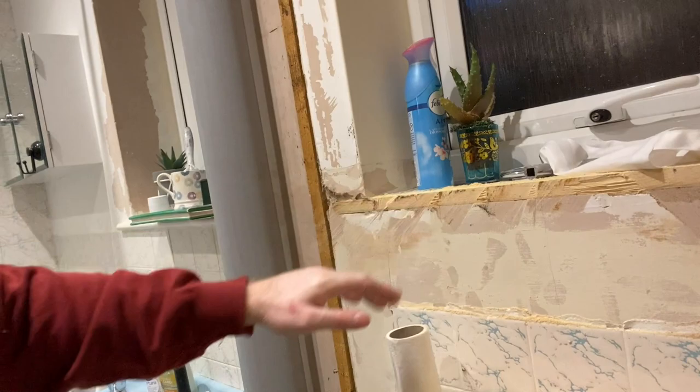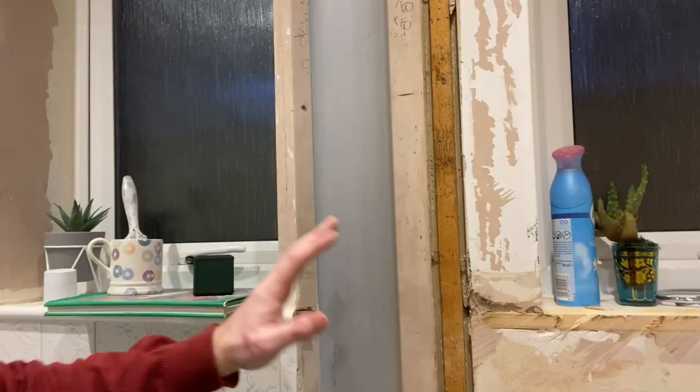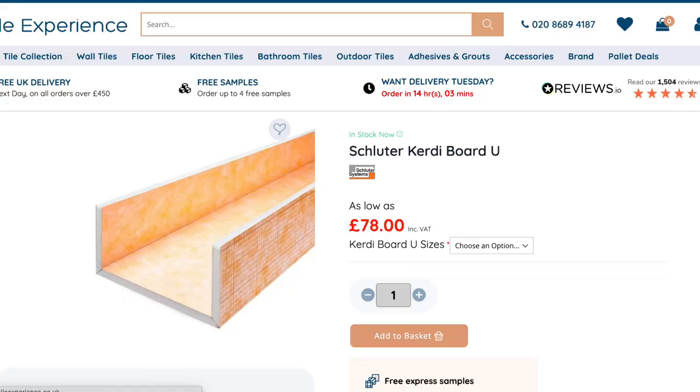You can see I've actually sawn off the ledge here because I'm going to tile right up to it. I've been looking at tile trims and grout colors. I was going to build a wooden frame and put tile backing board on and tile it, but I actually found a pre-fabricated U-shaped tile box made of thick tile backing board. The added advantage is I don't have to construct it, so there's less chance of me messing up measurements or getting dodgy angles - it should just be a perfect U-shaped box to screw into the wall and tile.